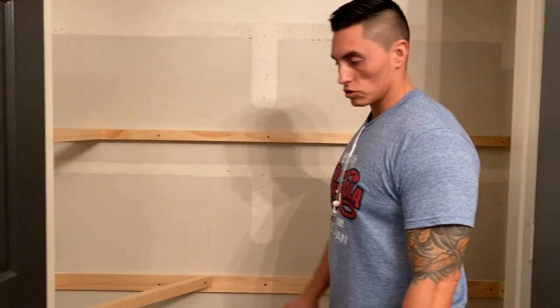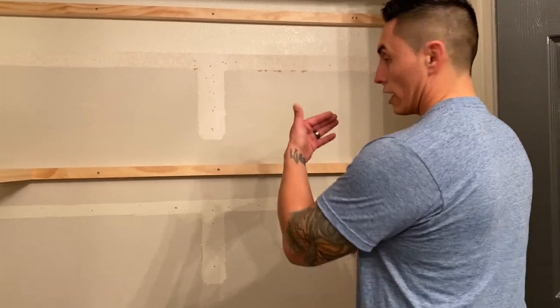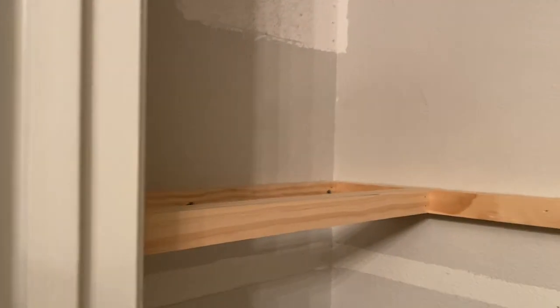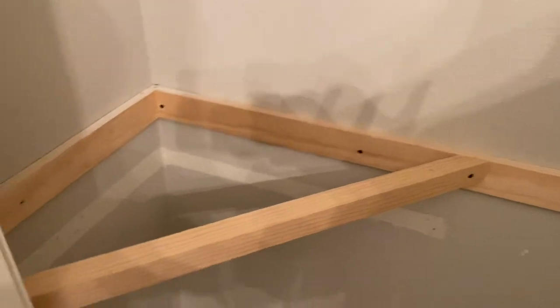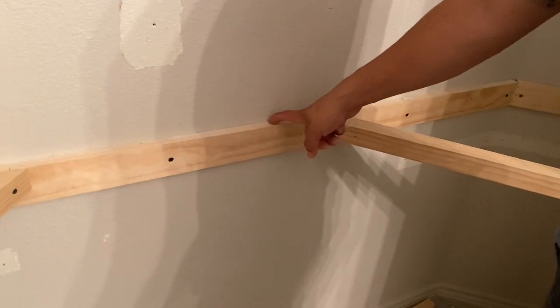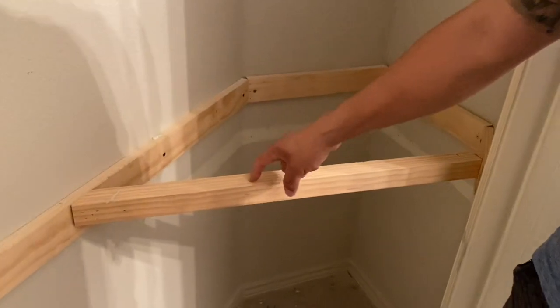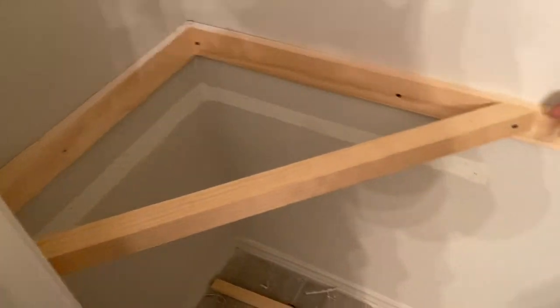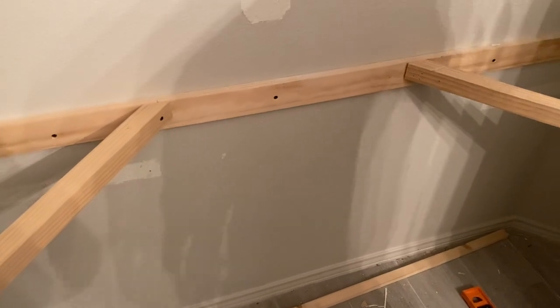Basically, one thing we did was make sure that the shelf can be lined up correctly, so we had to measure that. Most closets are square, and if they are it's a lot easier. This one actually has a corner that way, that one has a corner, and this one's flat. So as you can see what I did was first put the frame. For the back of your desk I actually used four-by-one lumber. And then these here are two-by-twos — this just frames out the whole closet, and this is just for added support.